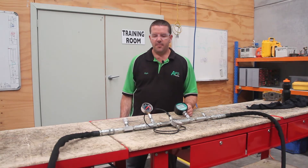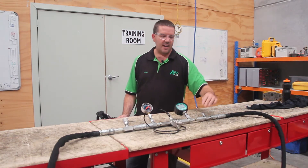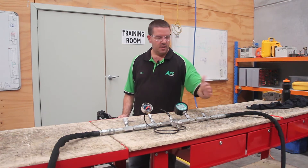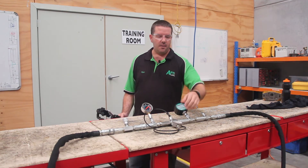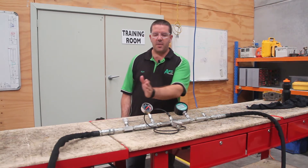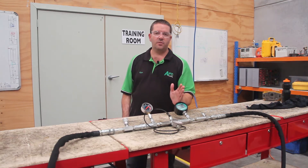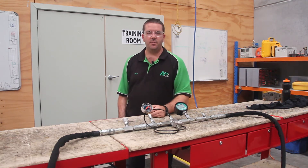So that's this week's Ask APT. We talked about a series circuit where each of the resistances add up. Now these might be hoses — the end one might be a load, it might be a valve bank — but they all add up in a circuit. And when we measure back at the pump, it's going to measure quite differently to if we measure at the actual load itself, and maybe some point in between.